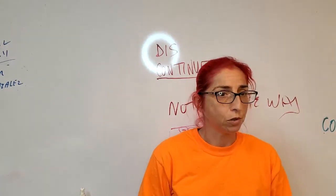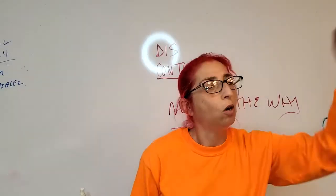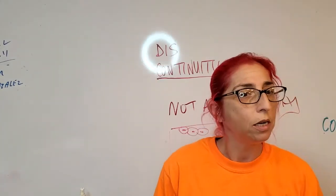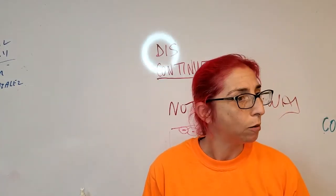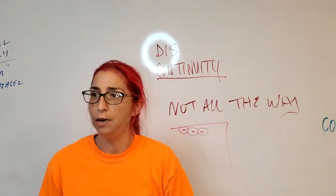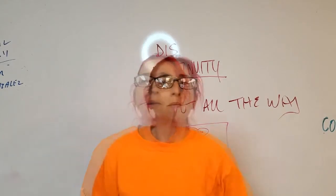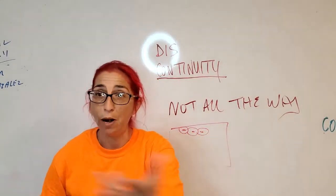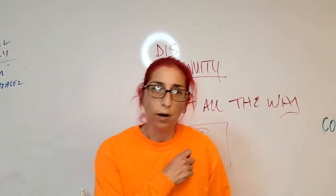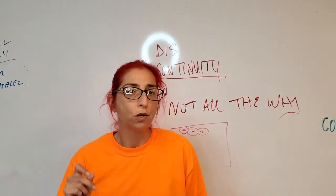But when it happens, how do we fix it? Because it will happen. What do we do? Arc length. Oh, you should say decrease, not increase. Anywho, what we really need to think about is how do we fix it? If porosity happens, which it will, I guarantee it, every once in a while it happens to everybody. It's not that you're a poor welder, it just means something in our atmosphere happened. So if it happens, and you see those bubbles, and you know that it's not good for my weld, we must grind it out.